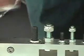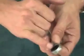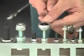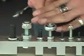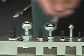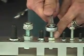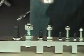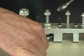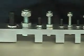An end user might try to use a traditional capstop wrench on this double nut situation. This kind of capstop wrench has a flange to stop the wrench from moving past the nut, so it can give very stable operation on the top nut. However, this kind of wrench cannot reach the lower nut in a double nut situation. In addition, this kind of wrench cannot be used in situations where you might want to use the tool upside down.